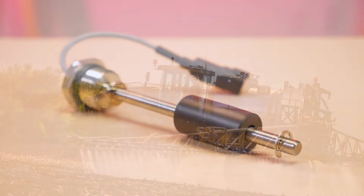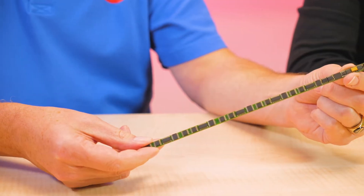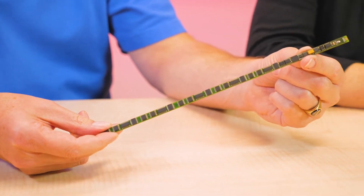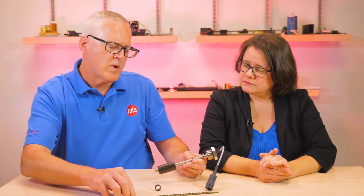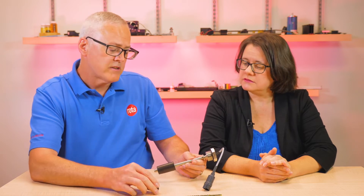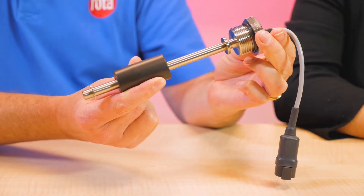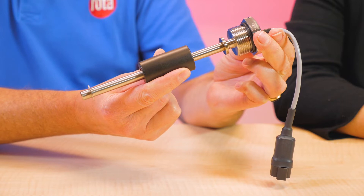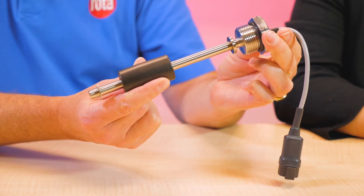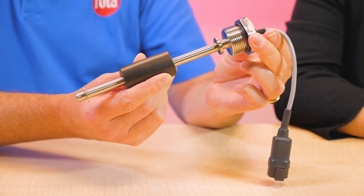And how do they work? This is just like all of our other technology — it's Hall Effect. We have printed circuit boards that have Hall Effect chips on them, and they actually live inside of this stainless steel tube. With our technology, one part is the Hall chip and the other part is the magnet. There's a magnet in the float material, and it rides up and down with the liquid level. It gives a proportional output — be it current, voltage, digital, pulse width modulation, just about anything.